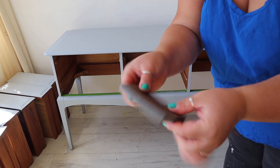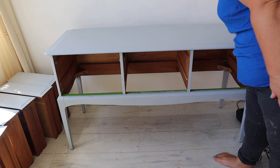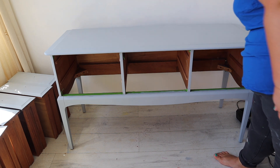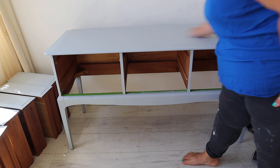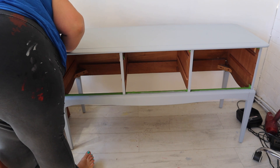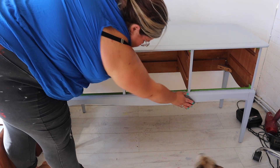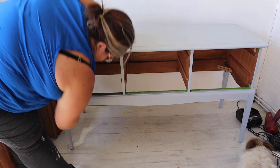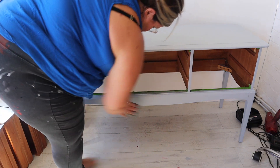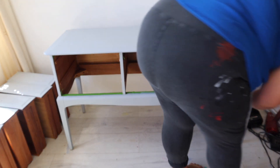The other thing that's going to really help you get a smooth finish is if you give your pieces a quick sand in between each coat. I'm using a Dixie Belle sanding sponge and I'm going to use the same sponge throughout the whole project because as I use it more it will start to get less rough, which means it will give me a less aggressive sand. This is the first coat of Boss and I'm just really lightly sanding between the layers.